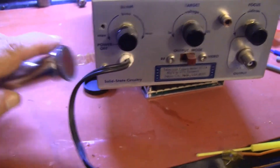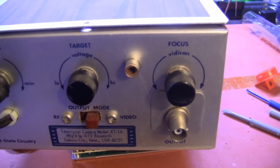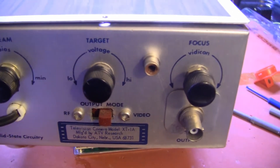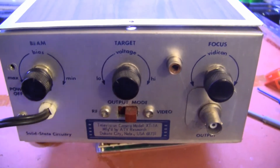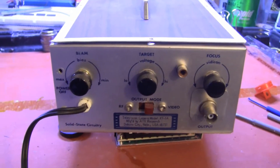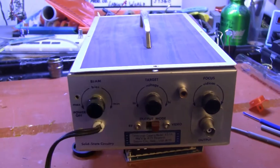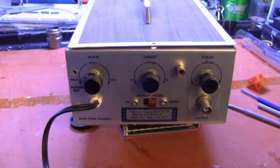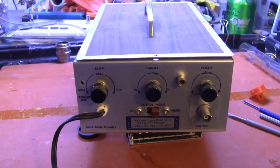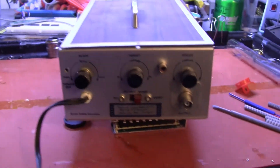This is the target. The final control is the voltage of the focusing electrode inside the tube. The tube uses a combination of magnetic and electrostatic focus. The magnetic focus coil — and that's in finger quotes — is actually a collimating field that makes the electron beam travel in relatively parallel straight lines to the face of the tube.